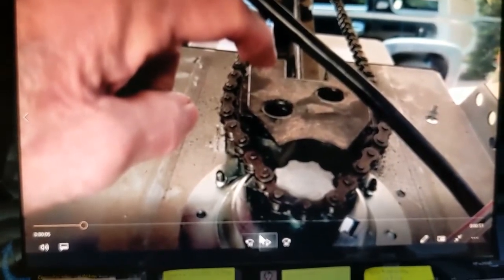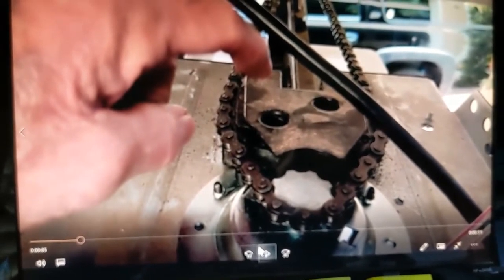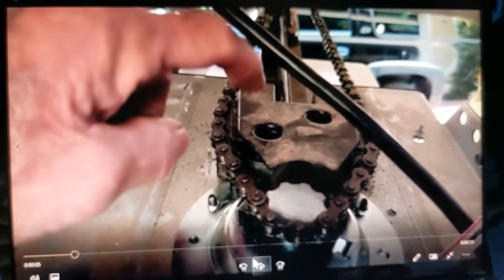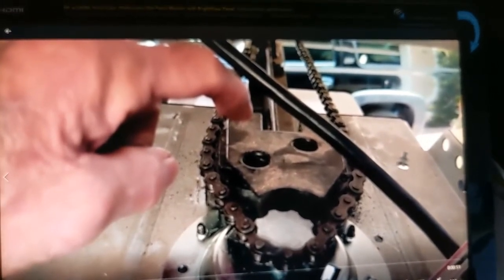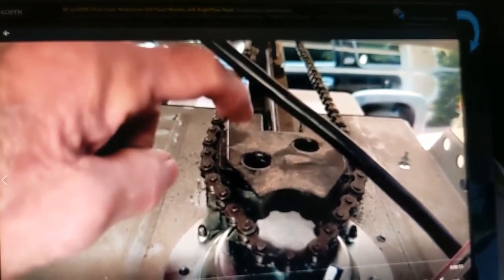Guys and gals, this is the final clip that I recorded on my camera — I had a little technical difficulty. But really, you have got 99% of what you need to fix the garage door opener if it's broken the way this one was broken. The only thing left was to screw the box back on, covering the place where you were working, and check your limiters. Make sure when it comes up, it stops before it hits that limit bolt I already showed you. And make sure when it comes down that the motor stops when the door hits the ground — if the motor keeps running, you're going to break something again. Give me a thumbs up or a like if this helps you out. Subscribe to my channel if you want more from Froggy, ring the bell for notifications. Be safe, have fun — Froggy out, bye-bye.